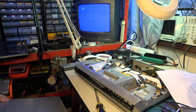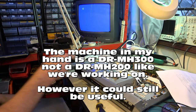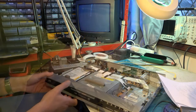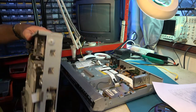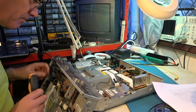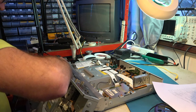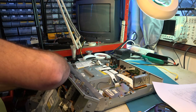I have another machine here, and a rather faded label says 'become unreliable and crashing — PSU service possibly required.' Well, I've just given that PSU a service, so maybe we have enough here to make one that works. I'll have to get that service disk out of there first. The DVD writer looks like it may be interchangeable with this one, so I could possibly drop it in at least temporarily to see if I can get it to read the boot disk.